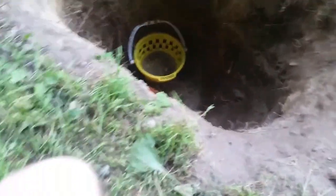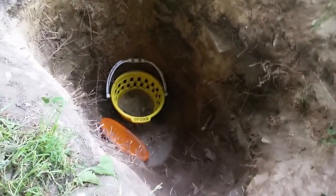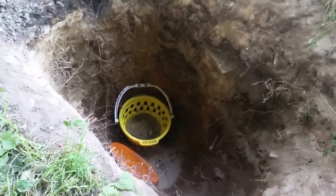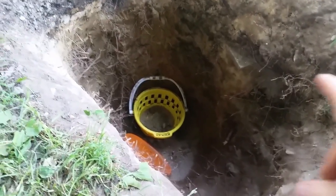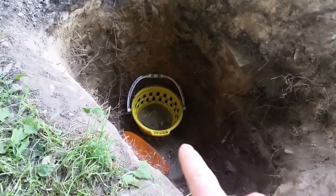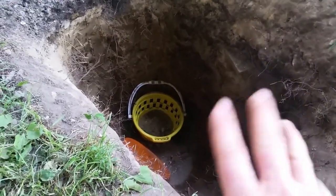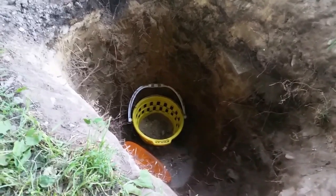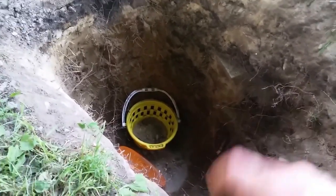Here's the hole. My daughter took such joy in playing in it — climbing out, getting her stroller, bringing her babies in and out. I need to clean it out and show you what the hose fitting looks like. At the base of the hydrant it was all sand. I'd like to put some stone in there because as water drains down the pipe I want it to have a place to go, and I don't want sand working its way into that fitting and clogging it.